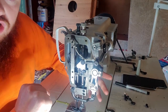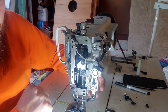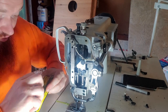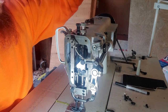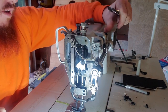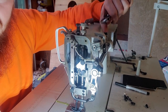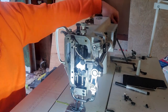I wanted to make this video because I chased this issue for weeks. This allen key — a size 5, from this Stanley set — is what fits in there. I loosened that size 5, loosened the screw in the back which I needed a wrench for because it was tight, and loosened the piece in the back. That back piece is supposed to control your lift length — something you can quickly crack open and adjust per project. I set it to center as my zero and went from there.